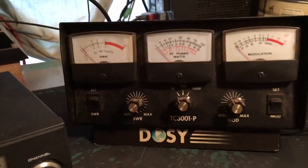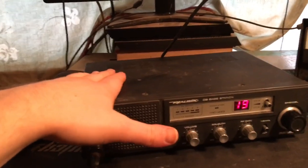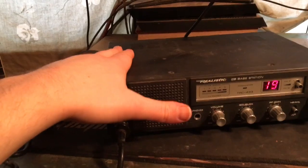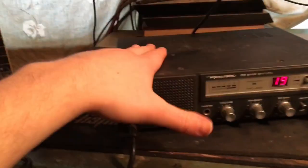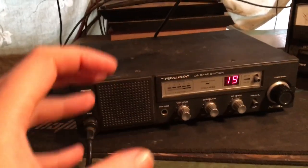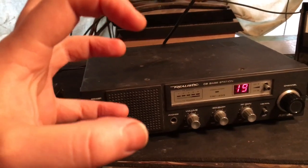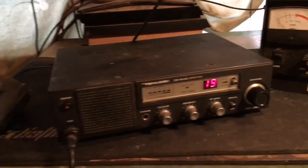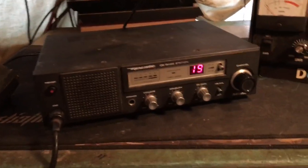About nine watts - this seems like a nice little radio. One thing I will say is I'm getting a little bit of transformer buzz here, which can be a little noisy. It's not audible but I can feel it. The laminated core in the transformer can sometimes break apart and buzz a little bit - you can fix that with high performance glue, but I won't go into that now.